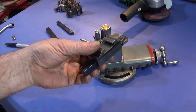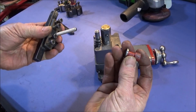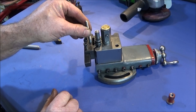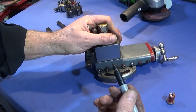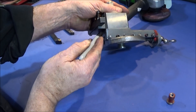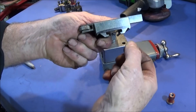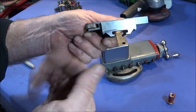I've got one of the hardened tool holders, removed the height adjusting nut and all the allen bolts, then dropped it on the tool post and allowed it to go down as far as it can go. Using a thin marker pen, I draw a line across the underside up against the compound slide, and that gives me the exact depth or width to grind off.